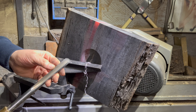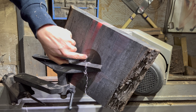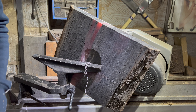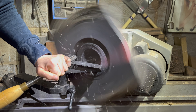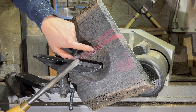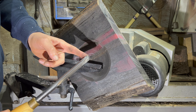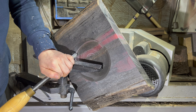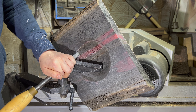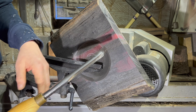I think it's just the resin blunting my tool really quickly. I'm going to give it a lot better as I come further out, not starting on the resin which is blunting it — I'm going to start from around here. Looks like bubbles but it's not, it's just chips from the bowl gouge. Even just this little bit is demolishing the edge on my gouge, so as I'm turning I'm not just using the bit I'd normally use — I'm rotating as I come around to try and use as much edge as possible.